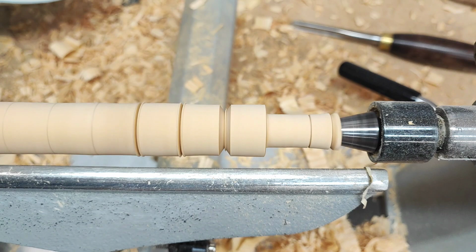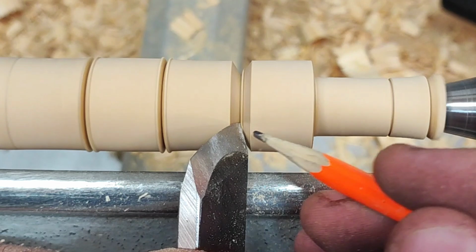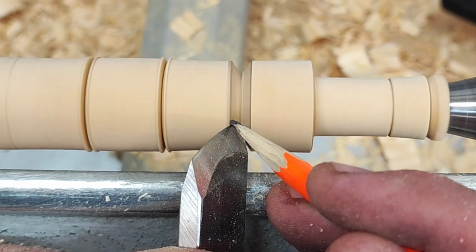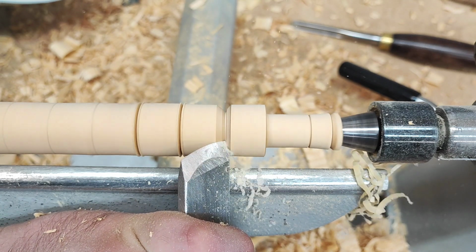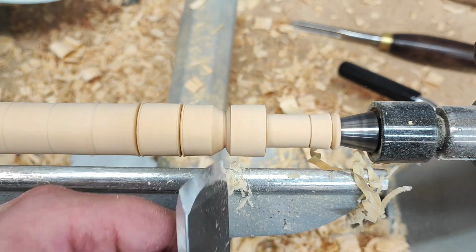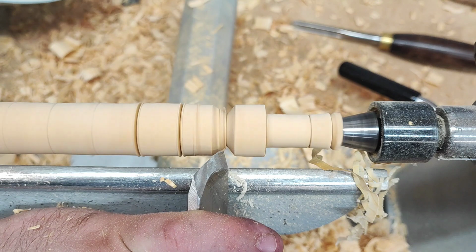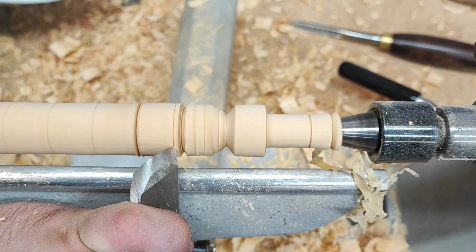And then you want to see a nice gap here. I'll try to show you. Here I'm cutting at the bottom, but here at the top, this edge here, there needs to be some gap. If you cut it, well, this is called side peeling, but it doesn't want to catch now, but doesn't matter, you get the point. There we go, nice catch. Another V groove here.